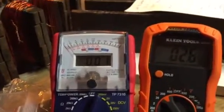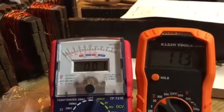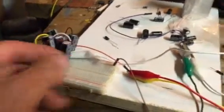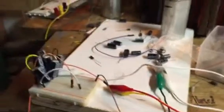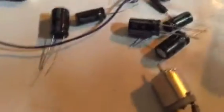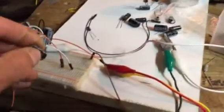There you go — you can see the amperage pull as current and then you can see the voltage drop. Now we'll do it again and watch the motor so you can see the duration. You can see it's taking a longer time for this bank to build back up. Let's put another jumper on here — here's the positive, here's the negative. We're up to 15 and change — touch this side and watch how long the motor lasts.